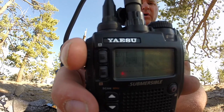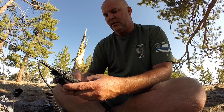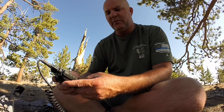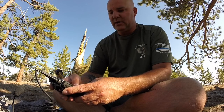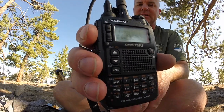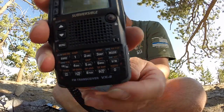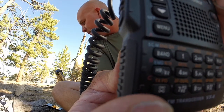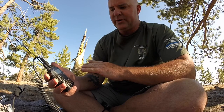Then I'm going to put 'on now' — or 'calling CQ' or whatever message I want. I like to put something short and sweet: just 'on now', and that way I don't have to worry about it. The other thing to note if you're using the alphanumerics — like the six button is M N O — obviously 'O' and you'd have to push it twice; once you get to your O you have to hit Mode to advance. You can't just keep toggling. Same thing for 'now' — N O W. Now that's all we need. To send this signal out there's the TXPO key, the little star thing on the very bottom left just next to number seven. Once I hit that, you see that — it made a signal, I could hear it, it transmitted.